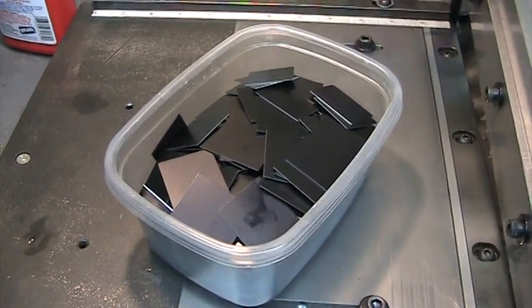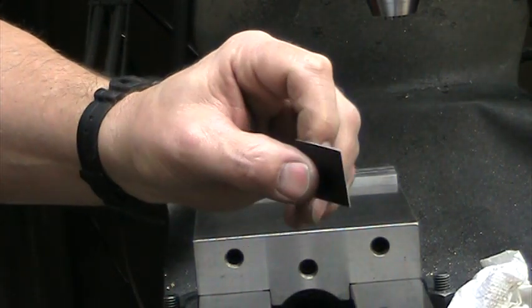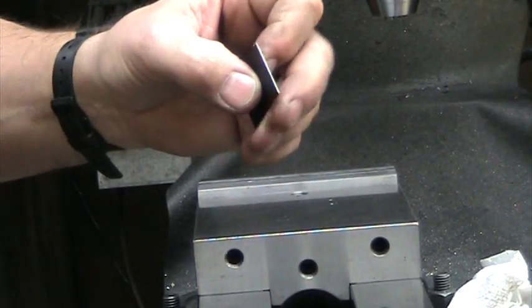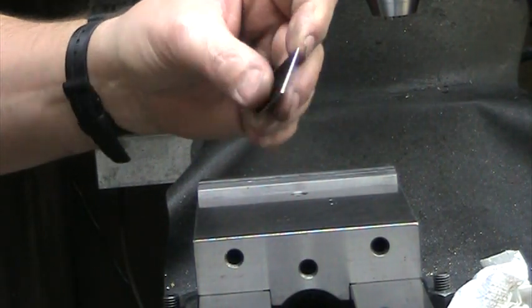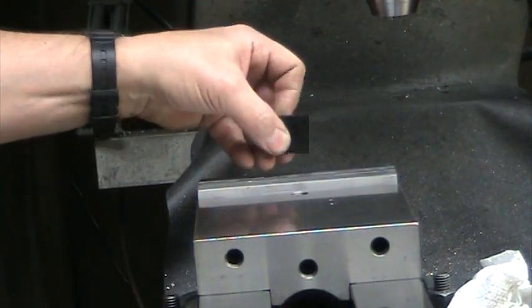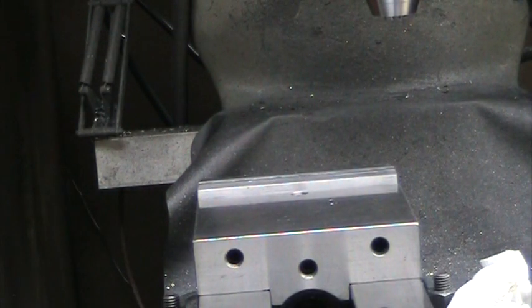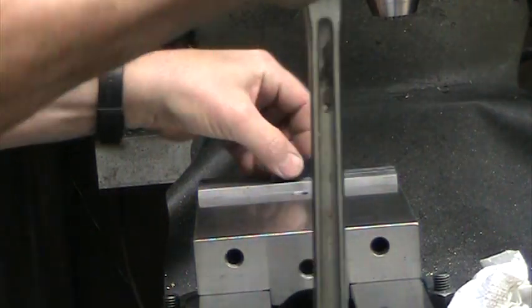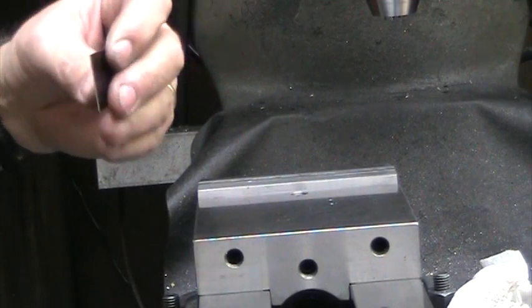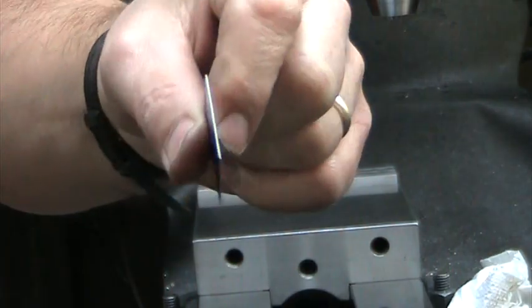486 pieces later, we're done cutting. When pieces are sheared they have a little curl on the edges, and I have to get rid of that because these need to lay flat on the resistors for good thermal transfer. I'm coining them using my vise to compressively swage them so they lay flat — each one done half and half. That just flattens the edges so the piece comes out nice and flat for the other bends.